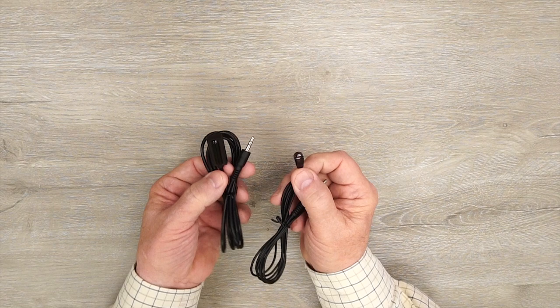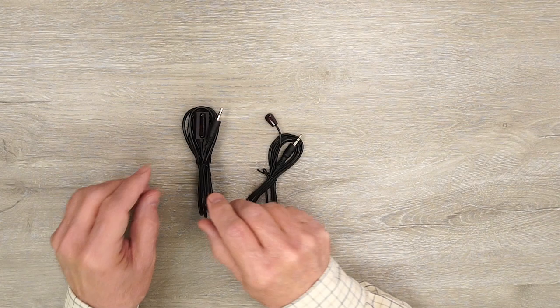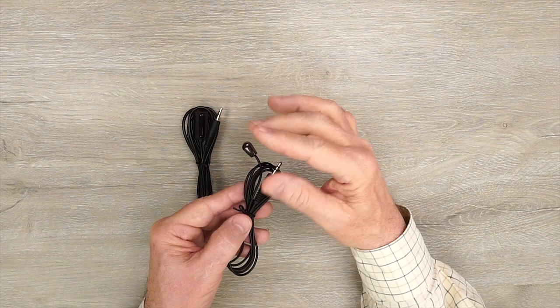You'll also find four sets of infrared blasters and they look similar but they're actually different. One has a larger head and the other has a smaller head. The larger unit plugs into the remote receivers at each of your locations. The smaller head plugs into the back of the matrix. At the remote location it picks up the infrared remote control signals, turns those into digital pulses, and passes them back over the LAN cable to the matrix, which rebroadcasts those to your media devices — giving you total control of the content you're watching.